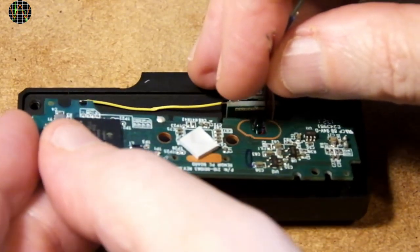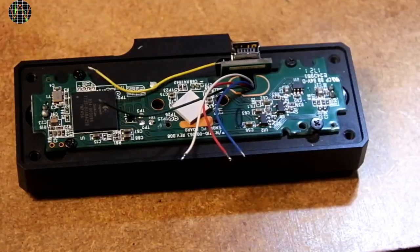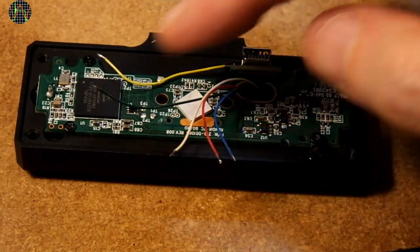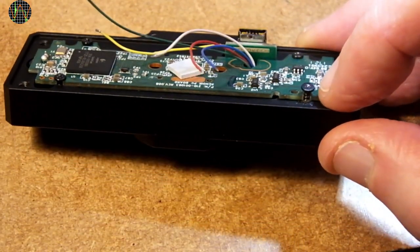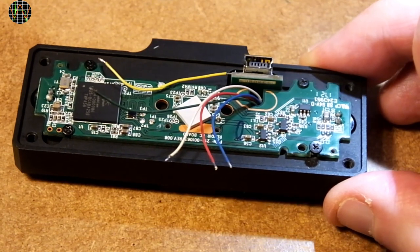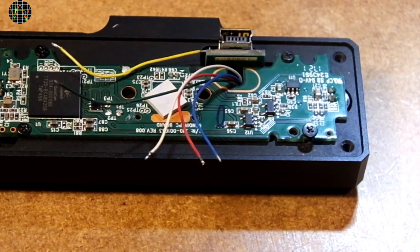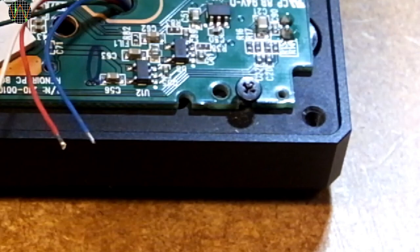Now to insert the PCB — it fits like a glove into the housing. The PCB needs to be screwed in and Kurokesu says to reuse the existing screws. This turned out to be problematic because many were no longer good enough to be reused. Also the screws are of different sizes and it is not quite clear which ones are supposed to be reused. I had trouble getting the lower right one in even though I tried all kinds of the remaining screws. My suggestion to Kurokesu is to not rely on reused screws and provide four properly sized new screws with the kit instead. In my case, although that screw isn't pretty, the PCB is secure and the back shell still fits, so I am going to leave it as it is.